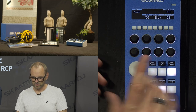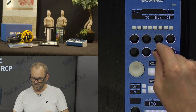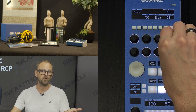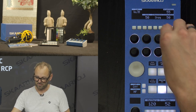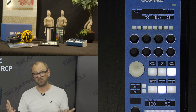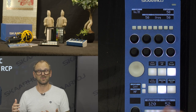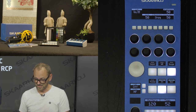Moving on to the image menu, you can see brightness, contrast, sharpness-related parameters, and saturation. To demonstrate brightness — if I turn this knob, you see the image becomes brighter. That's a nice way to fine-tune your brightness from the image, though obviously you'd use the lens iris for the main adjustment of light intake.